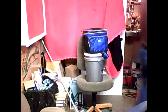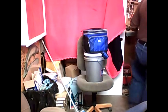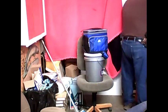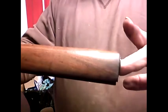That's one coat of polyurethane on this. I'm waiting on it to dry. But like I said, if you'll remember, that stock was in pretty bad shape. Now this has just turned out pretty good so far, and I've got 2 coats of polyurethane on this. But I still got a couple more to go. I'll let this finish drying. I'll sand it down again, and I'll put a couple more coats of polyurethane on it.